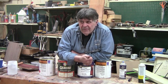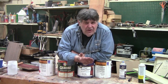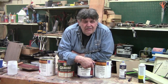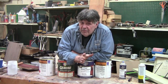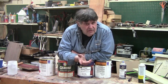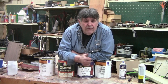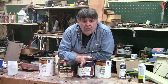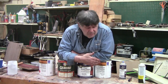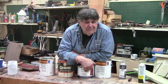I'm going to go out on a limb and tell you upfront — my favorite solvent-based finish forever is Deft. Not the most durable. But if you're doing a high-end furniture project that's not going to take a lot of abuse or wear — a little nightstand, picture frames, something that won't get a lot of wear and tear — there's no finish in the world I'm aware of that's easier to work with and looks better on wood than Deft. For years we used the Sherwin-Williams moisture resistant, and it did well.